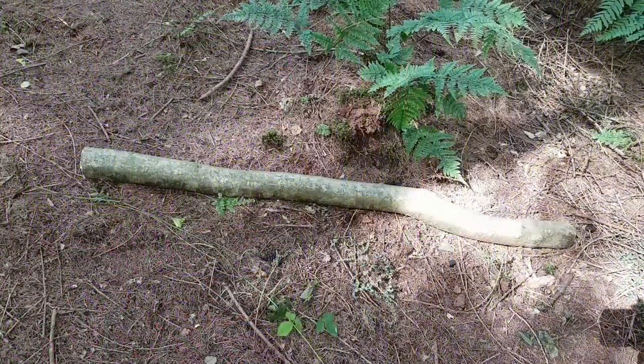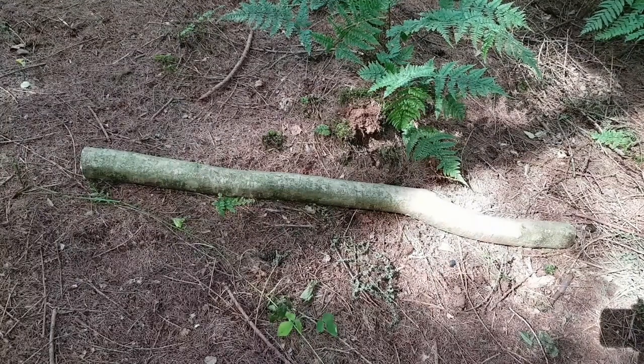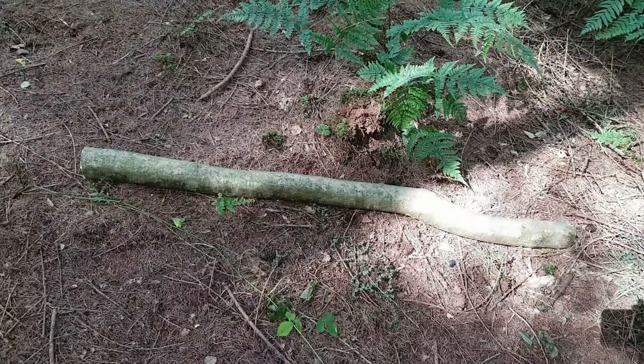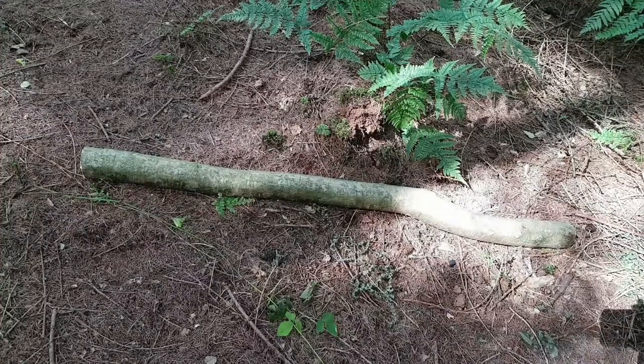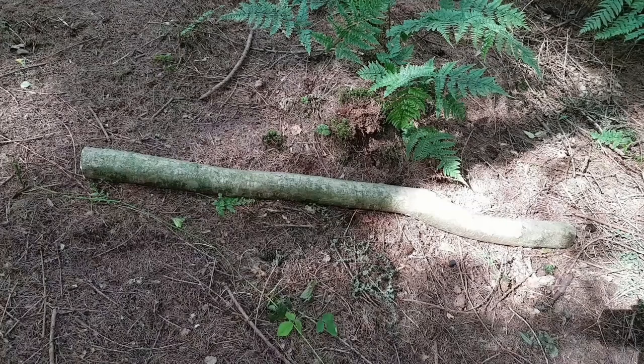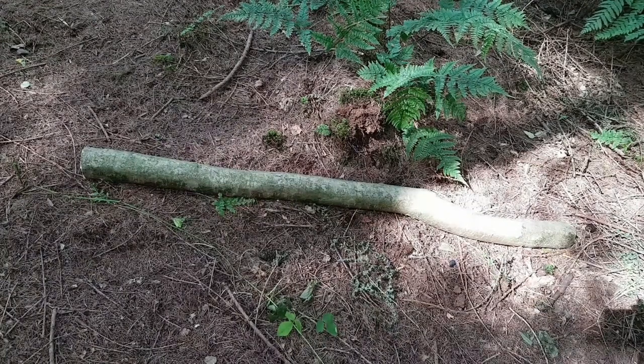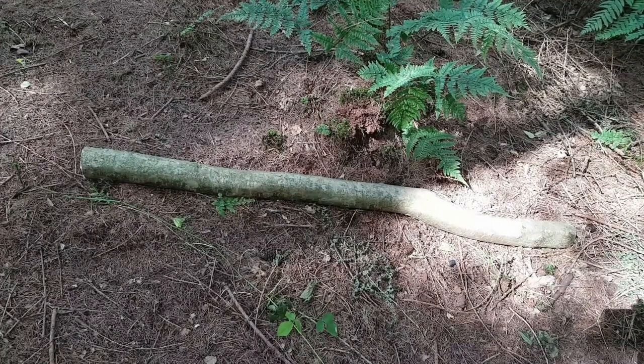I've cut a piece for the stock. I'm using hazel. You want the stock at about 7-8 centimeters thick, which is about 3 inch. I've done mine about 1 meter long. It's about 40 inches. My crossbow is going to be quite long. You can make yours shorter. I want to be able to shoulder mine like a rifle and have my head in a position where I can look down the bolt whilst I'm still holding the stock nice and securely.